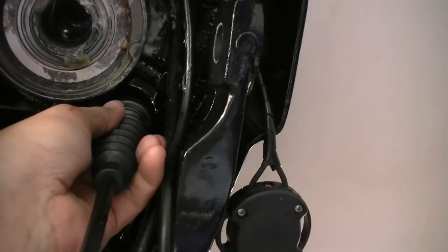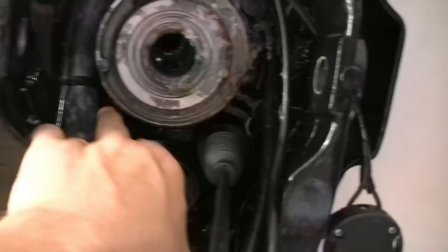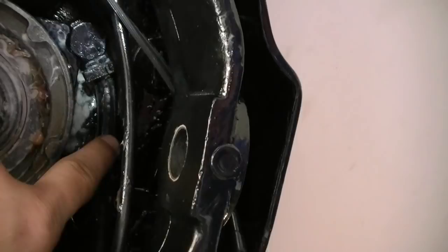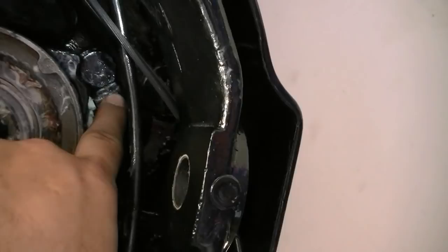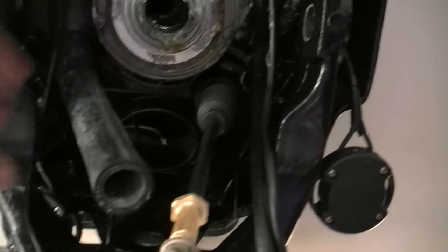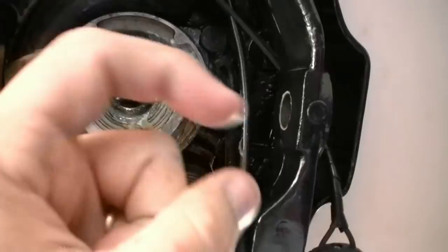We've got the hose here. The trim cylinders come down. You need to make sure and put your trim cylinder retaining clamp on there. This little piece here is the fill hose that actually goes to the reservoir for the gear oil for the outdrive. That is very, very hard to put on, and there's a plastic little clamp here that they actually snap in. You need to make sure and put that on there nice and neat. This was very difficult to get in here, but if you take your time with a little bit of lithium grease, it slips on perfectly fine. We're going to get the bellows on next, which is basically just putting the bellows adhesive all the way around here, slipping it on, and then using my long screwdriver that has a flex shaft to tighten the clamp.